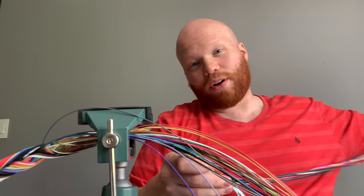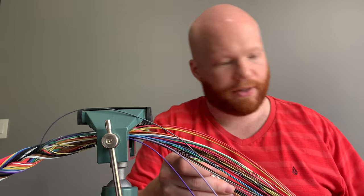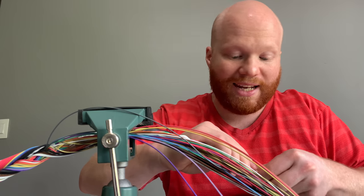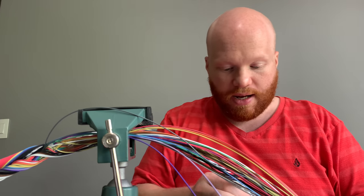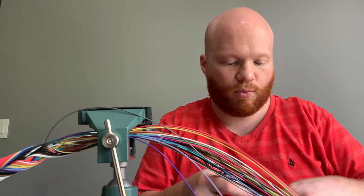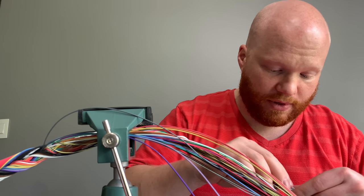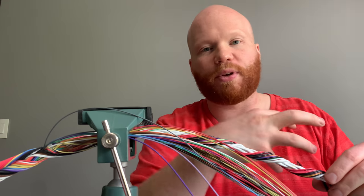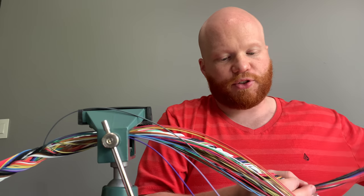Just so you're aware, F1 harnesses tend to be linearly twisted just because they don't want to run filler wires, because that's extra weight. And as we know, in that level of motorsport, weight is the enemy. You do not want any extra weight anywhere. And if you do have to, you'd rather be underweight, because then if you have to add weight, you can usually add it back into a more advantageous spot. F1 harnesses also tend not to need so much strain relief because they're usually contained in some kind of carbon enclosure that goes throughout the chassis. So not so much of a big deal.